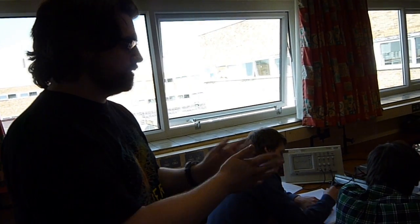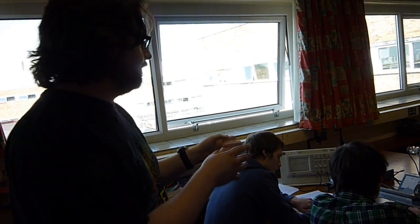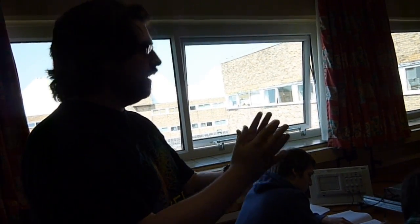These students are doing an ultrasound experiment. They have a receiver and a transmitter which they can move along an optical bench, and they know the distance between the two objects quite precisely because of the bench. The oscilloscope displays the signal coming from the receiver. They can move it along and see the shift on the oscilloscope, which tells them the wavelength and time period of the wave. They can also see how the amplitude of the ultrasonic wave dissipates as it gets further from its source.